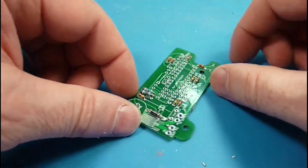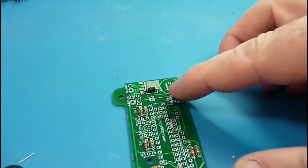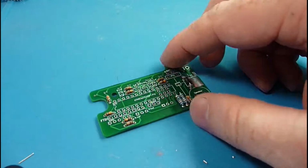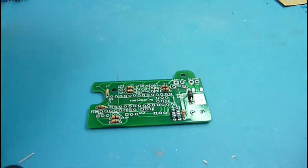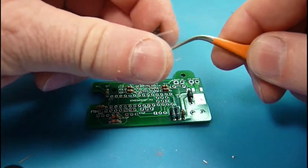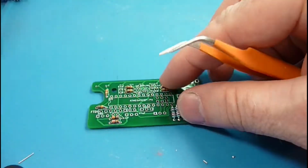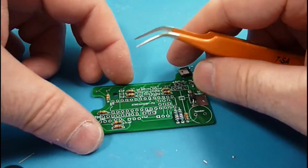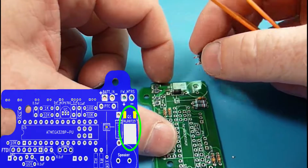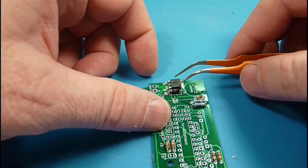Okay, and speaking of our MOSFET, I believe it is time to do him up. And this is one of the tricks that I mentioned I'm going to throw at you. We're going to use a surface mount component. The reason I did this is because the footprint for this is significantly smaller than the through-hole component, and given the constraints of the board, that was really just how I decided to do it. And I think what you can see is this is really not that difficult.